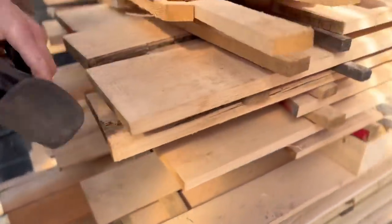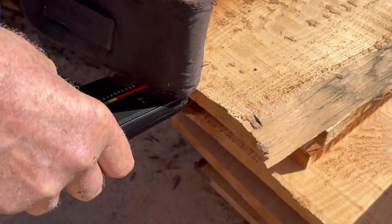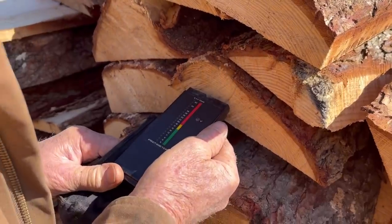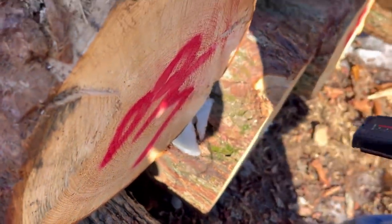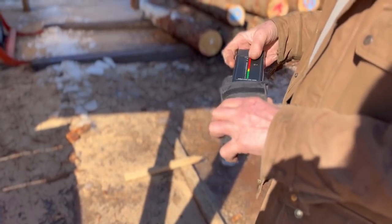You go out here and measure one of these fresh ones that you cut — that's 14%. This big piece of log here is 20%, 20%, 15%, 17%. Those are all green ones that we just cut, greener. That's 19%, that's 25%. I'd say it's working pretty good, especially for winter when the sun is not nearly as hot and it's not shining nearly as much in there — it's doing pretty good.